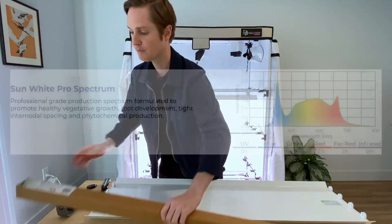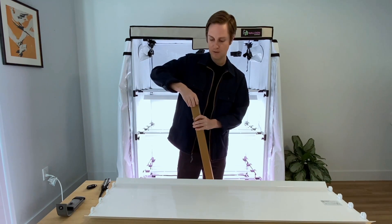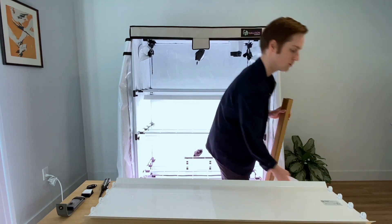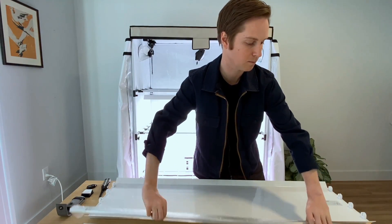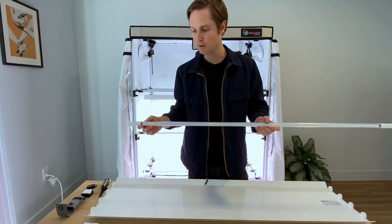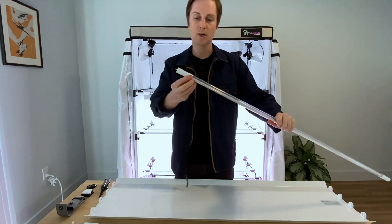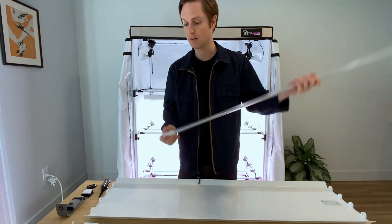Now I'm going to install the lamps. These are the Sun White Pro lamps and they are 25 watts each. These 25-watt lamps replace the traditional 54-watt T5 fluorescents, so it's going to be less than half the energy use. All these lamps are plastic — shatterproof, so if you drop them you won't get shards of glass flying everywhere. They're very sturdy and able to handle the rigors of a horticultural environment. They're closed off on the end so water has difficulty entering, and you won't see any condensation in a lamp like this.